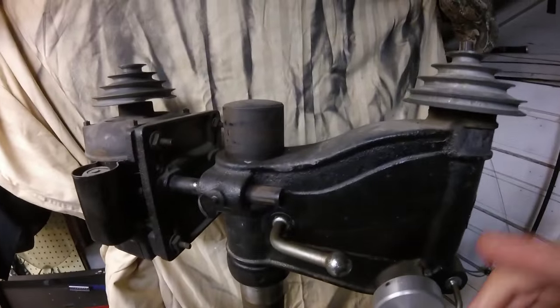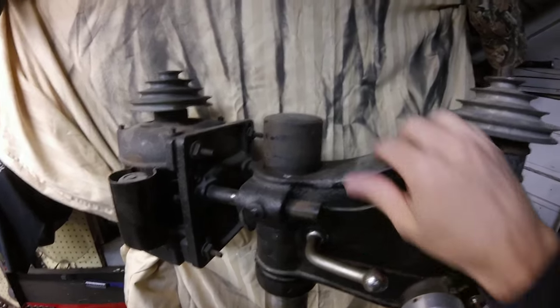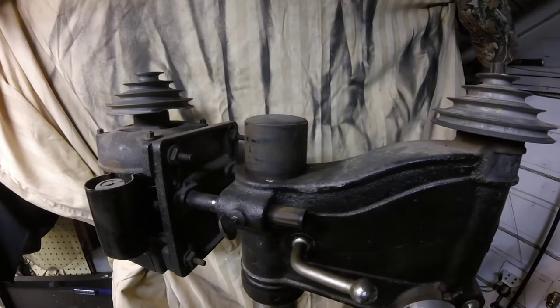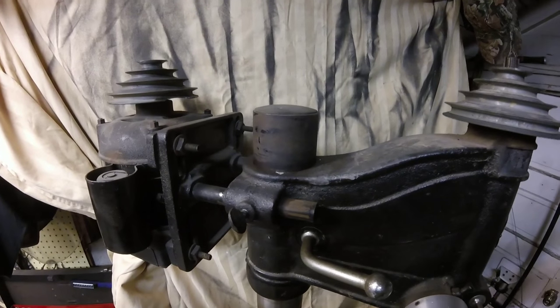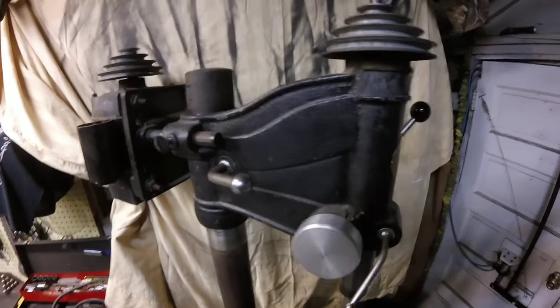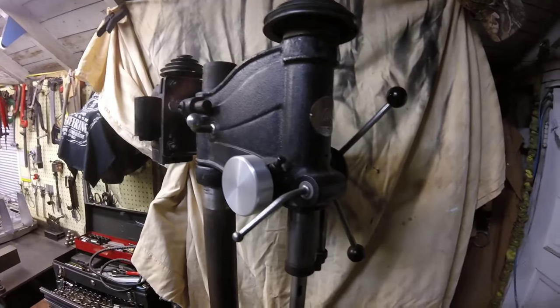What I'm going to do is add an intermediate pulley — an intermediate step pulley right here. Just got to make a bracket for it, buy a pulley and a couple more belts once I get it in. We'll put it on and try it. That will decrease my RPM to somewhere where I want it.